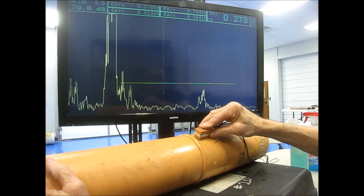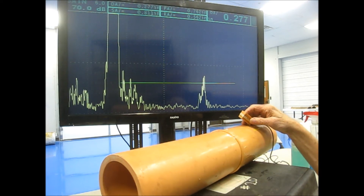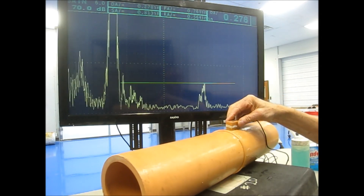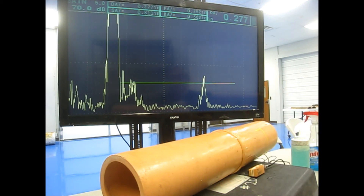This joint I'm working on — I think it's a four inch, it's 0.425 wall. This technique I think would work with much thicker material. I've got a low frequency phased array probe that I could put on a wedge like this — I'm sure that would be very spectacular. This technique was a pleasure to use, it really works great, and if you're interested, give me a call. Thanks.